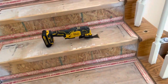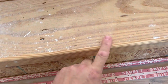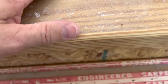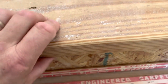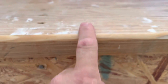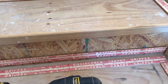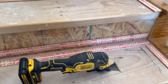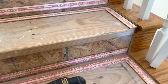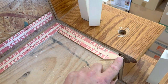What I did on these steps: I took a 3/8th router and gave this just a little round to it right there. That way it's not just coming over a directly square edge. It's got just a little round to it and that will preserve that edge from breaking down so fast. It'll help it out a lot. And I used to take my tack strip cutters and cut all of these on a 45.